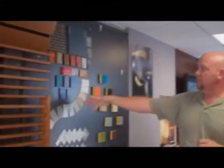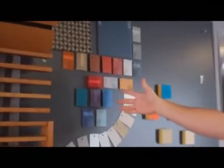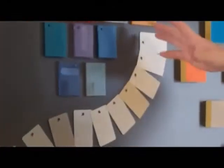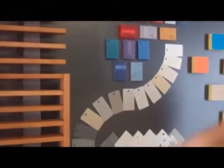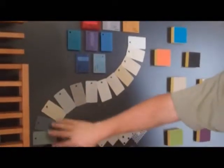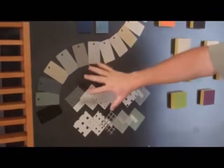Continuing to come down the line here, we'll get into some of our clouds and canopies. This is our infusion panels — acrylic panels. They come two by five or two by six, and they have two types of curves, either a 90 or a 60 degree curve. You can also do those as a lay-in ceiling tile as well. We'll get into Serpentina, which is a metal cloud system, like you would see in some of our details. Different perforations, all different colors.